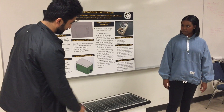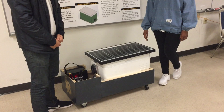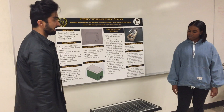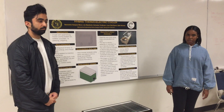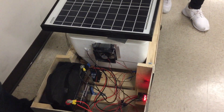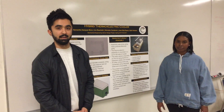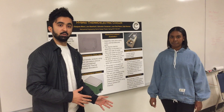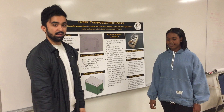We also want to adjust the sizing and equipment of the wagon, and we were planning on using a smaller battery as another addition in our future design of the hybrid thermoelectric cooler — improving both design and aesthetics to make it look better as well as work better. In just about a couple of minutes here, the temperature has already dropped about a degree and a half, and it continues to drop incrementally. The lowest temperature we achieved was approximately 16 degrees Celsius, which is about 60 degrees Fahrenheit. With a bigger thermoelectric plate, we hope to cut that down dramatically — right now it's a 6-amp plate, and if we bring it up to 8 or 10 amps in our future design, we expect a much larger temperature drop.